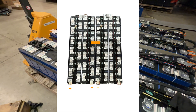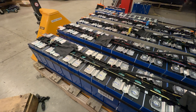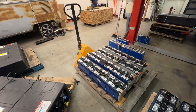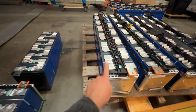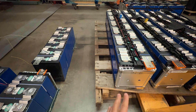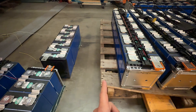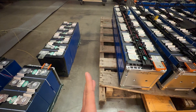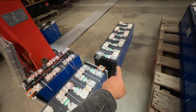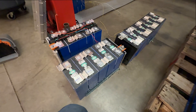I'll draw a quick diagram of how this would look. This is DIY — this is an opportunity to get really cheap, really high-quality CATL cells, brand new, zero cycles. Also, we just listed the 13S modules now so you don't have to take them apart yourself. We're also going to try fitting these into regular Chinese DIY boxes that are on the market, and we're pretty confident it's very possible without much modification. We have the 13S modules and the 8S modules available — we basically did the cutting for you.